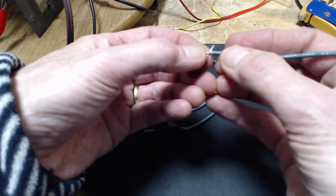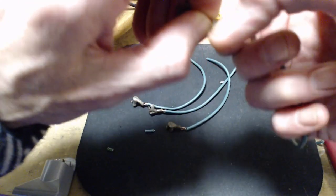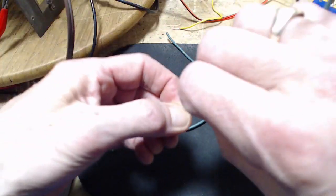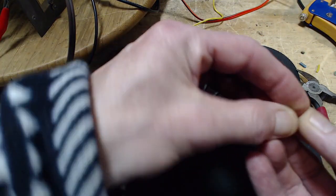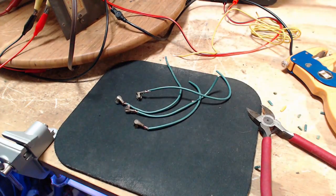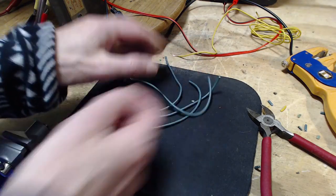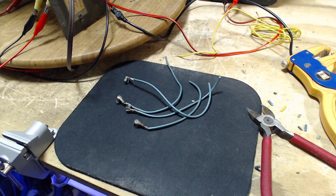So just solder these guys up and stick them in the radio and then attach the other end. We're done. And I don't imagine these were having any real negative effect on the radio, but they really do need to be changed. Somebody down the road is going to change one of the tubes in here or something. They're gonna move this wire, and the ruined insulation here is going to come into contact with the chassis. Not after this is done. Okay, I'm going to carry on.